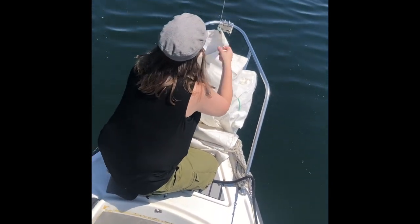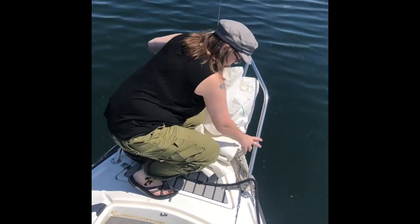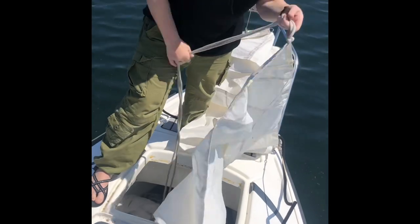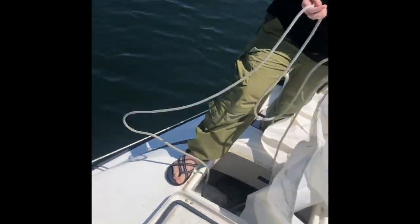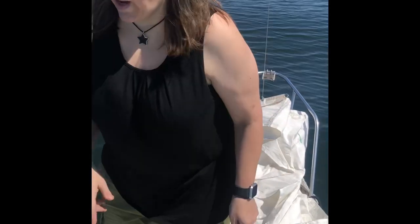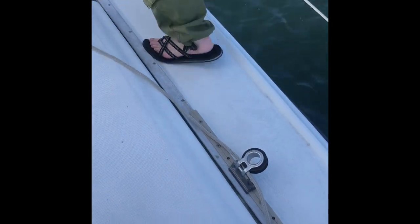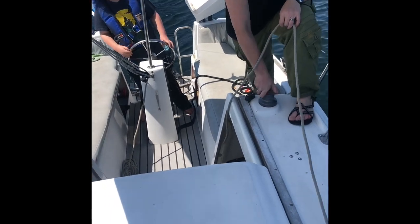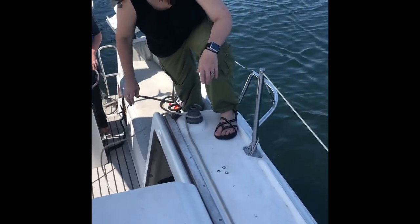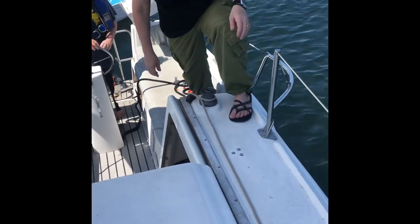I'm going to take the end of the jib halyard and attach it to the top ring. But first, I'm going to unfurl the rest of my jib and stick it in the jib cars. Each of these are the jib sheets. I'm going to take one side — if it was the Genoa I would take the sheets and pull them around the outside of those. But it's the jib, so I have my jib blocks down here. I'm just going to reach it through the block, then loop it on the winch — it only turns one direction, and that's where you want to loop it.